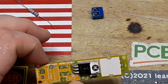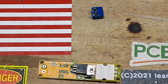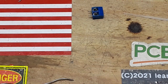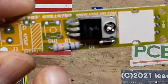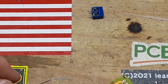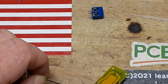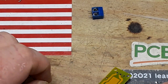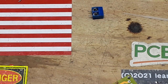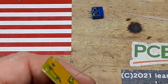Next up is our 33 ohm one-watt resistor — a 33-watt resistor would be pretty doggone big. And for my friend Florida Man, the resistor is oriented so it can be read left to right, as God intended. We'll get that soldered in there — again, nice shiny Hershey's kisses.